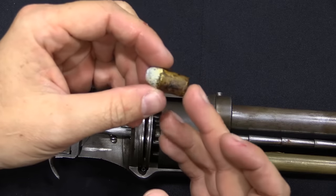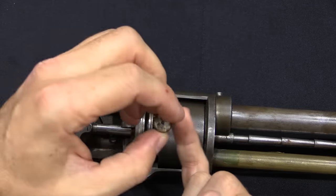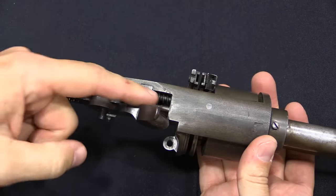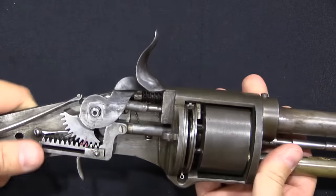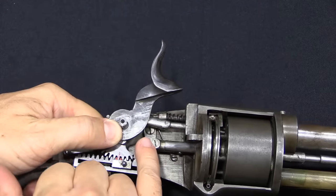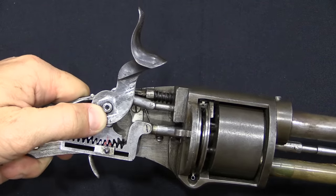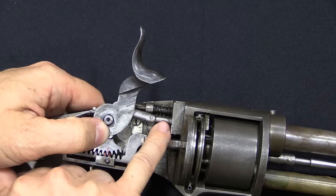The cartridges are 1 inch long each, approximately .48 calibre. These are dummy cartridges that are full of aquarium sand, so nothing's going to detonate here. Inside the rest of the mechanism we have a couple other things going on. This is our cylinder stop that is going to lock the cylinder in place. And again, when the cocking lever goes backward, you can see there is a lever right down here that is going to pull the cylinder stop out and allow the cylinder to rotate. You have a striker right here that's going to go forward when you fire to actually detonate a primer.